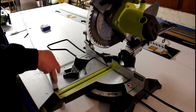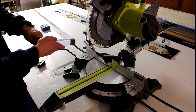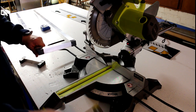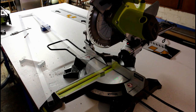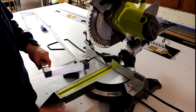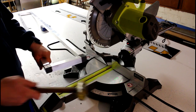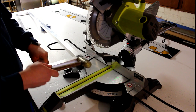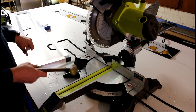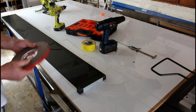You can see here how easy it is to put the frame together, and it's not too hard to pull it back apart again if you do have any issues. From here the assembly is pretty easy. My initial plan was to screw the composite panel to the square tube, but because I needed to countersink the screws, there wasn't enough wall thickness left in the tube. So plan B is to double-sided tape the tube to the composite panel.